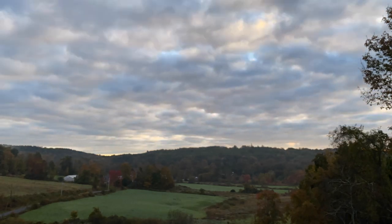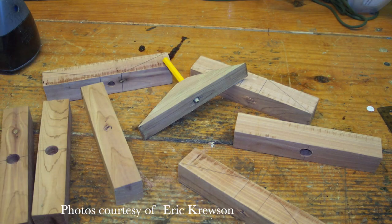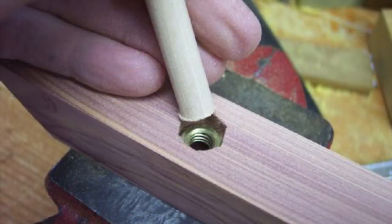The first and best known is the notorious tillering gizmo. I believe they were invented by Mr. Eric Krusen, and they have since become very popular. It's an incredibly simple device, just a block of wood with a pencil that sticks out the center. The pencil is threaded through a nut, so you can control how far it sticks out of the board by giving it a little twist.